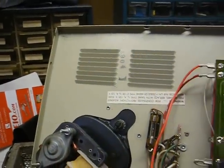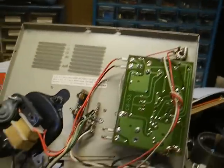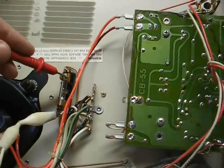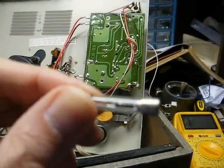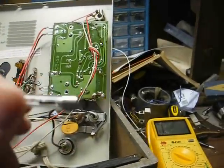It could very well be blown. There's really not a whole lot that can cause one of these not to power on. The continuity buzzer's working — and yes, we have a blown fuse. The label looks like a one-quarter amp fuse, and this looks like a slow-blow type.